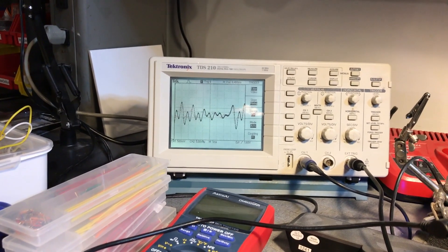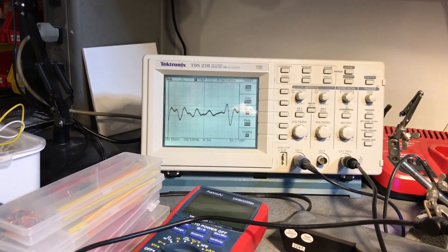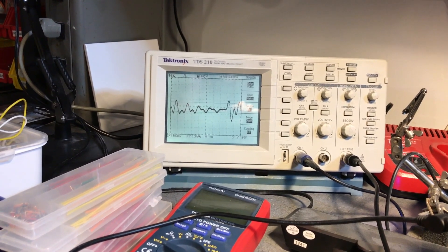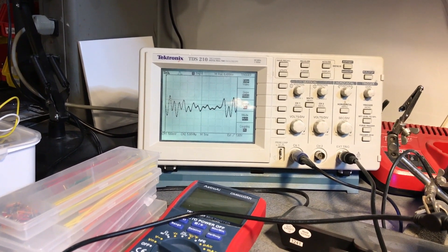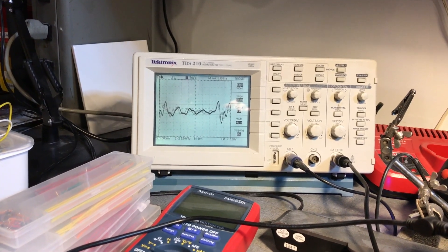This is what the thing kind of sounded like. Granted, I can do this digitally pretty easily now — it's just three cascaded bandpass filters. But the distortion I get from the germanium transistors, the low headroom in this circuit, and the way it's saturating just give it its own brand of distortion, which you'll hear in the final product in a few moments.